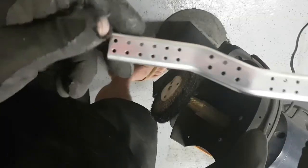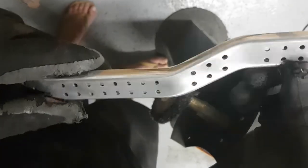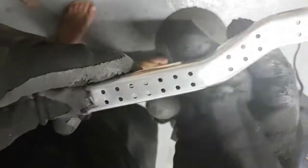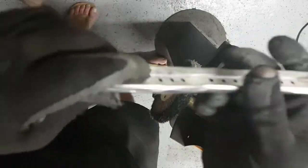We've just finished with the brown — you can see that's starting to get a little bit of the luster on it. I'm going to quickly hit it with some 1200 to get rid of the little bit of coating left on there, sand that off, and then hit it again with the brown. I've hit it again and got all the final little pits off, and now it's ready for the final polish with the brown and then the clean-up finish with the white.